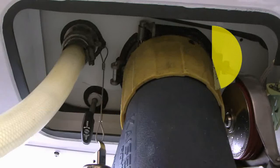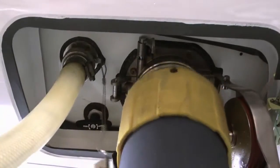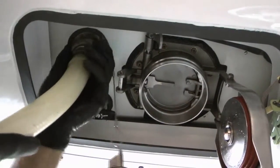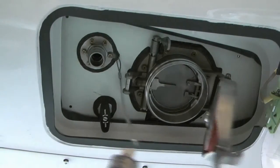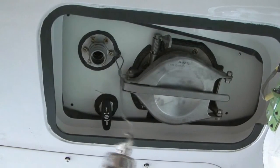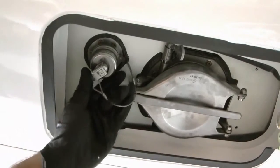Flush the waste tank with water through the RTS rinse valve for about 3 minutes. Unlock and push the T-handle in after all liquid is drained. Disconnect the lavatory dumping coupling from the RTS servicing panel drain valve. Disconnect the lavatory filling coupling from the RTS rinse valve. Close the cap of the RTS service panel drain valve and latch the lever — the flapper valve closes automatically when the cap is closed. Install the rinse nipple cap on the RTS rinse valve. Close the access door, which will close only if the RTS waste drain valve is correctly closed.